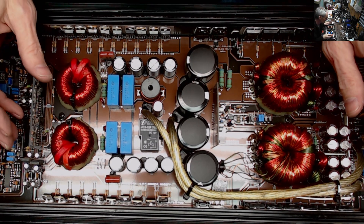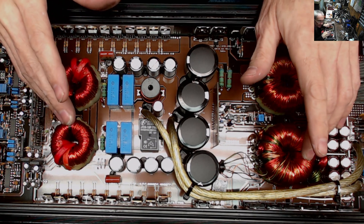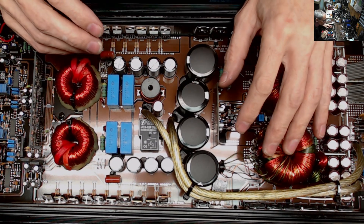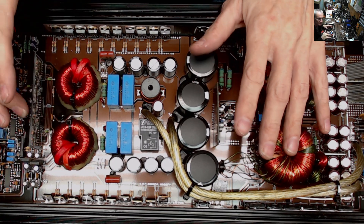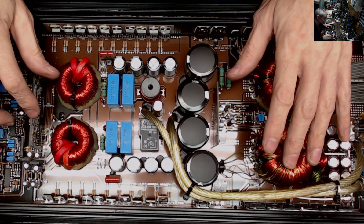No obvious shorts, but it would power up and power off, so there's a protection circuit triggering. I'm getting a sine wave into the output drive card. Switching is a little iffy, but these cards are notorious — you've got to rebuild them.